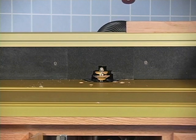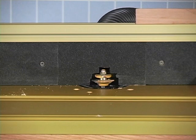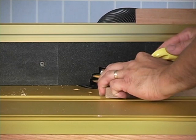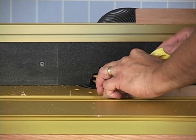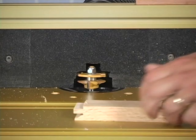Whenever you're making a cope cut or any part of a door, always run the good side down. So with the good side down, I'm ready to push that through using a push block up onto the fence. Right there are the copes on my top and bottom rail of my door. With our sets being matched, I can go ahead, swing my fence out of the way,